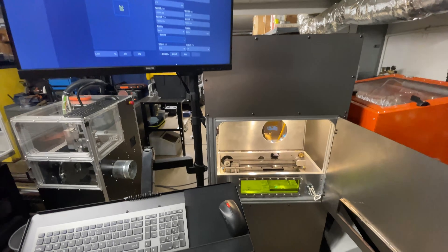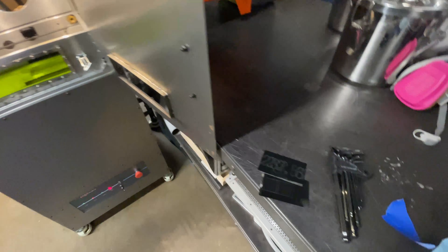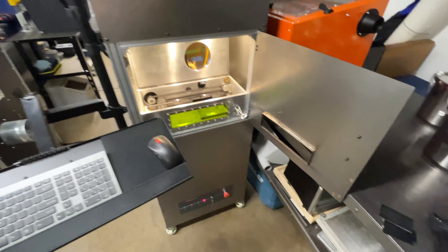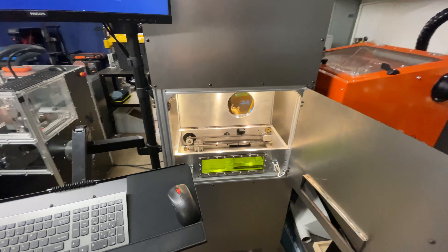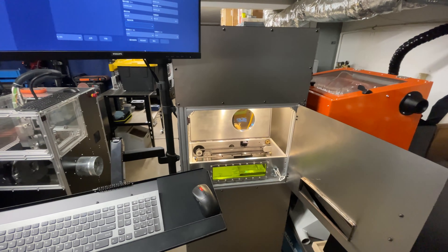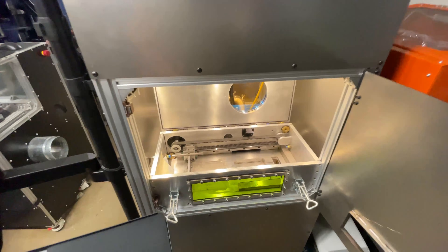The third change is the laser focus. Metal Matters, Metal Base, and Mr. Zing from JYM all three pointed this out in the feedback. I did some focus tests and found out that I'm 17 millimeters out of focus. That means I need to raise the scan head 17 millimeters higher. I had it positioned based on the specifications and never got around to actually testing and confirming this distance. Sometimes I make really stupid mistakes, so a huge thank you to you guys for pointing this out.